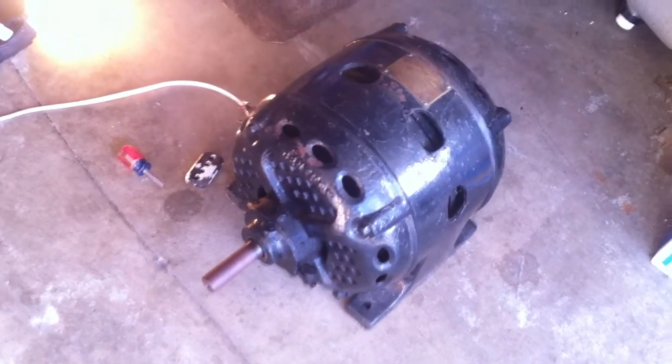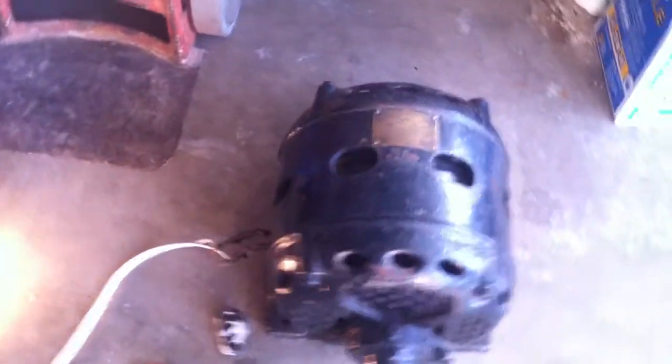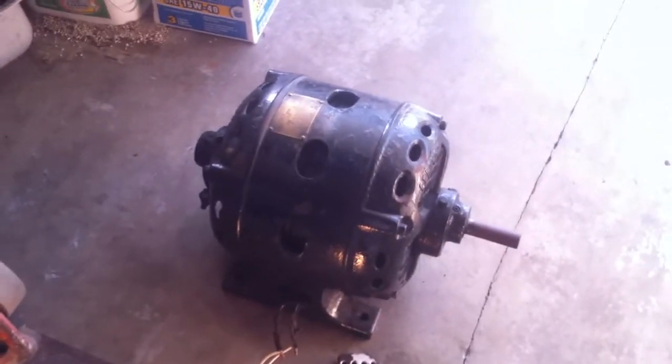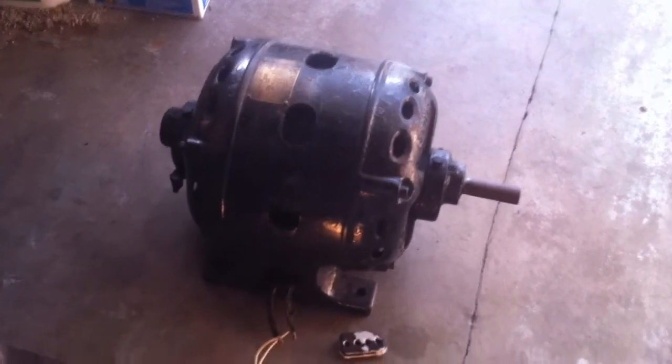I'll get the measurements of this and put that in the description as well. I put a shim under one foot so hopefully it'll run a little more smoothly — the instructions talk about bolting these to a solid foundation. It's still overspeeding but not nearly as bad. In our previous video we measured it getting about 2600-2700 RPM, and when I first fired it up I heard the beat frequency disappear almost to zero, like it was getting to about 3600. So it's definitely not revving out as high as it was.